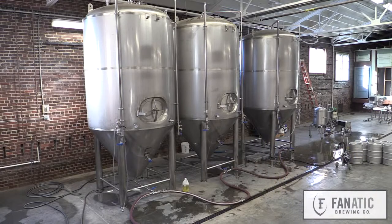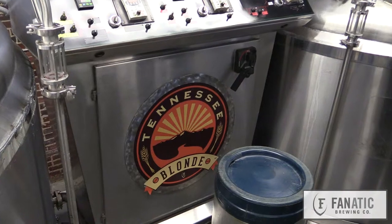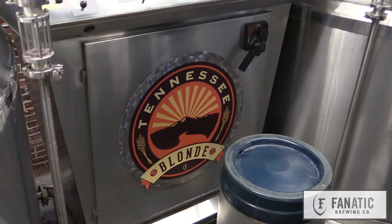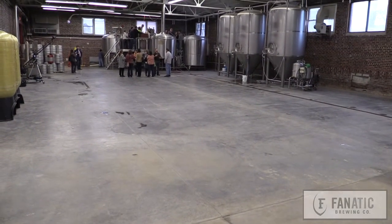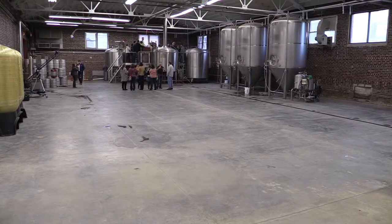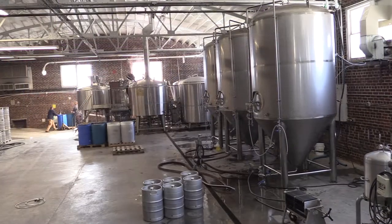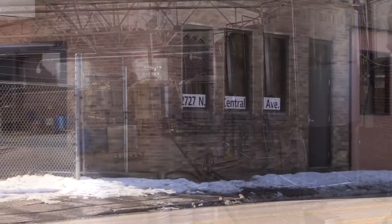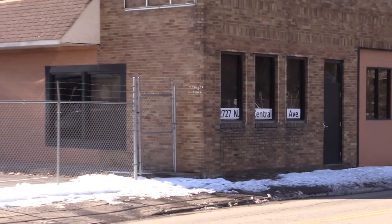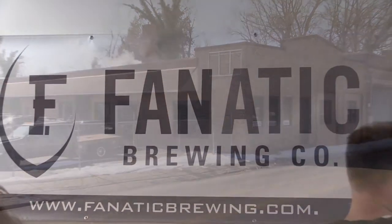After fermentation, you've got carbonated beer with yeast all over the place, so these tanks are all jacketed with cooling solution that runs throughout the brewery. We've got a chiller in the back sending cooling solution through the jackets, which allows us to control the temperature. After fermentation we bring the temperature down — there's a ripening period where the yeast is actually re-absorbing some of the constituents it made while it was actively fermenting, and that cleans the beer up. Beer does have an aging period, and then we drop the yeast out when it's done its job. The cones in those cylindroconical tanks allow us to harvest the yeast, and we'll actually reuse the yeast from tank to tank, about five generations, and then we start fresh.